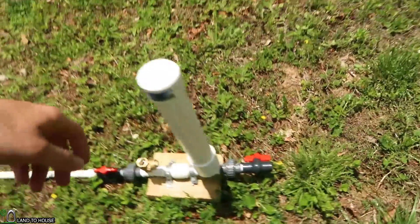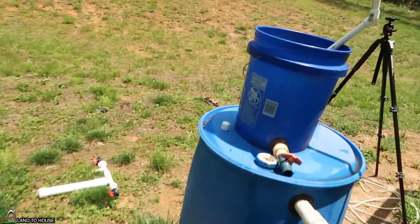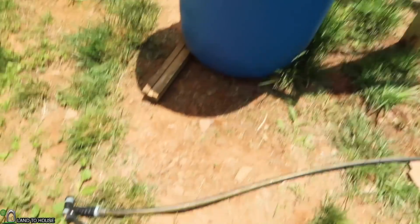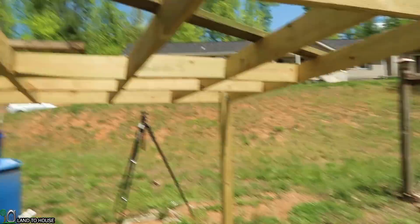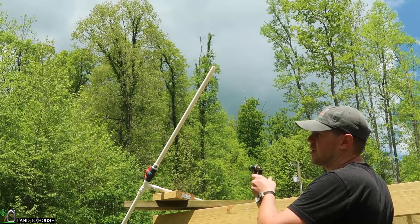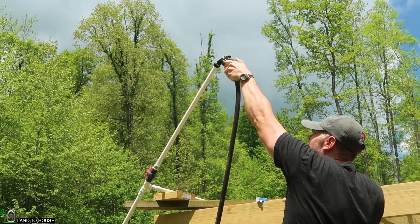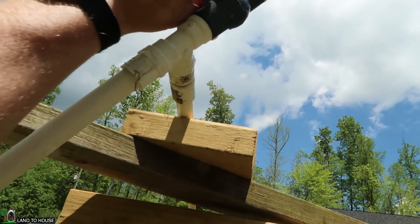To begin, let's go ahead and close the delivery pipe and the drive pipe. Let's go over here and cap this end. Now I need to use the garden hose to fill this tall standpipe that I have up above here. First I will need to open this valve. I want to mention again that it's important to fill from the highest point. If there are any higher dips in your drive pipe, it'll make this part difficult. I'm just going to sit here until the whole thing is full. Now I want to close this valve just like we did with the smaller example.